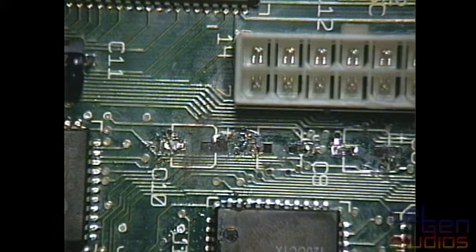Back in, say, 2011 or so, I first got the real impression that I should start pulling these caps off before I have any irreversible damage, because leaving them on there will cause problems. However, I didn't have all the tools I have now. As I've mentioned in my previous decapping video with pliers, working with a soldering iron is absolutely crap for removing these caps. And as you can see, I've lifted a fair number of pads. So we're going to have to do some crafty things here to try and make any of these work.